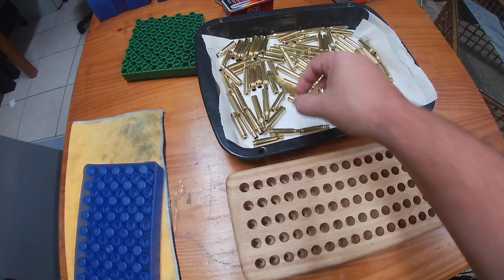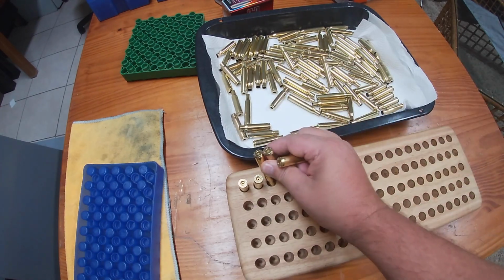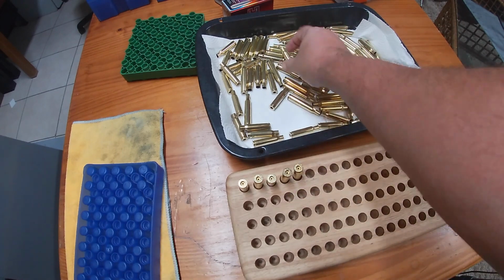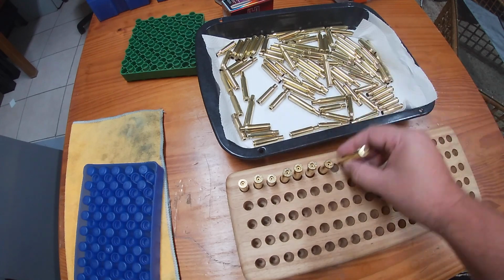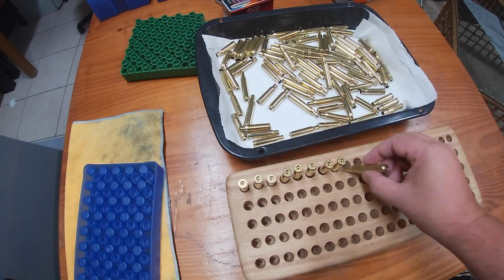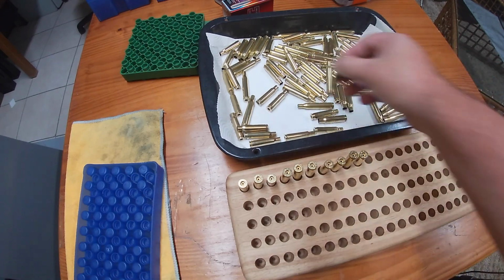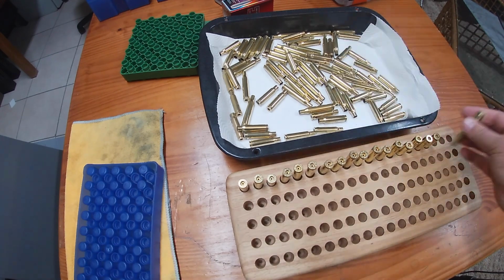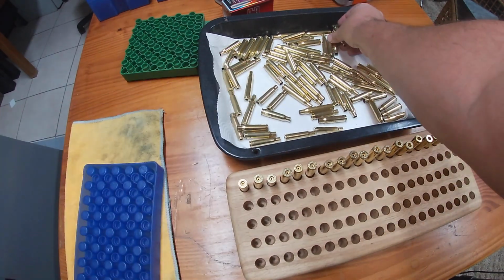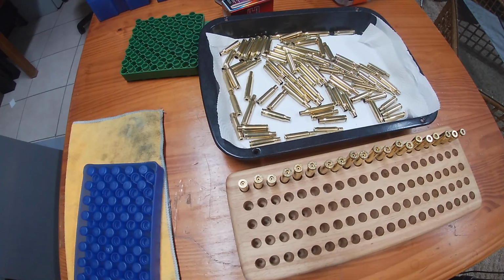So what I'm going to do is just pack the casings back in order here. 270s together, 308s together, primer pockets up, because the next step for the next video is we're going to have to put some old primer casings back in so that we can measure the volume of each of the casings. First measure and trim the casings, then put the old primers back in the primer pockets so that we can measure volumes of the casings. But for now, I'm just going to speed up for you guys.